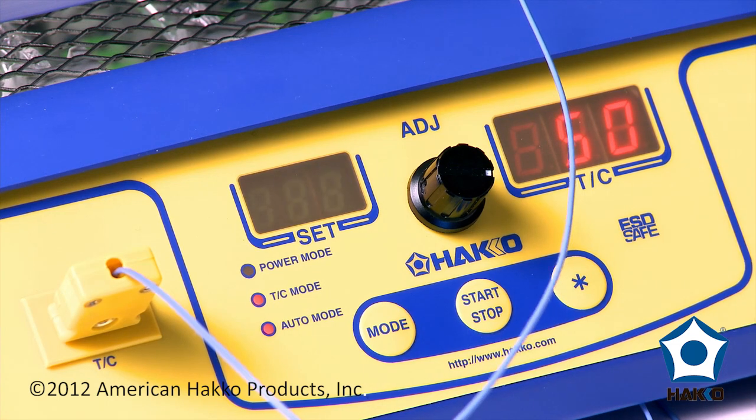That's going to change that program to F0. Now I'm going to have six different parts in this program. There's going to be a target temperature and a time for the first stage, a target temp and time for the second, and a target temp and time for the third stage — three different steps in a rework process, same thing with the preheat.